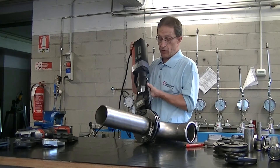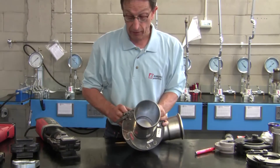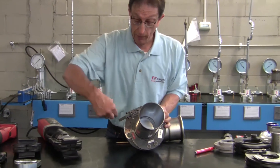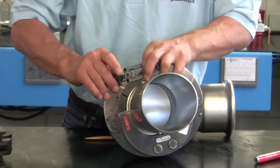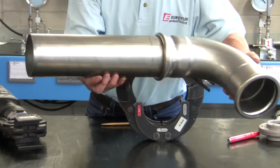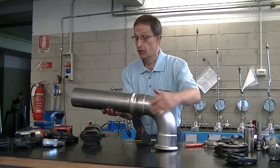Here is the end of pressing audible signal — pressing is complete. To open the chain, very important: don't pull, just push downward. Click — the chain opens effortlessly. Here it is: a perfectly pressed fitting, state of the art.